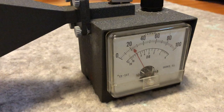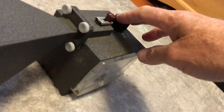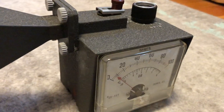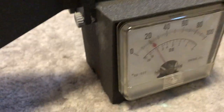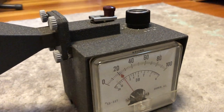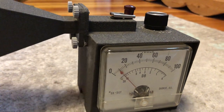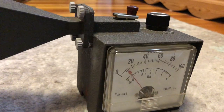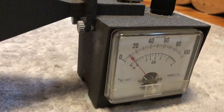I can see there is some current passing through the diode. It's got what's called a gain control, but it's actually just a simple potentiometer that controls the current going to the meter. So it's pretty simple. If you move the antennas out of alignment you can see the signal strength varies as I move away from the axis of the transmitter on any plane. Also, if you put your hand in the way it absorbs the signal — so it stops the signal.